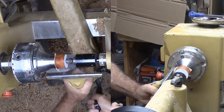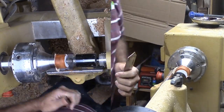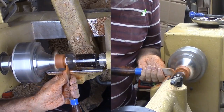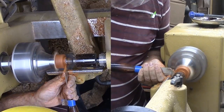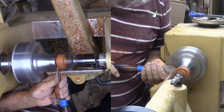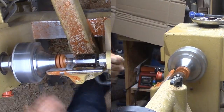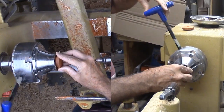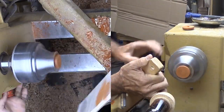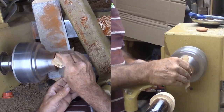I have a lot of small padauk rounds from my pumpkin project — this is a perfect opportunity to use one. I'm mounting it to the face of the long nose jaws with double stick tape and live center pressure. While mounted here, I'm cutting a tenon on both sides, being careful between the wood and the jaws. Then with a parting tool, I part the wood in half. Before moving on, I'm cleaning up the surface and edge of both pieces, then sanding them up through the grits but not applying lacquer at this time. This is the background of the features I'll cut with the infinite axis chuck, so now is my best chance to smooth out the background.